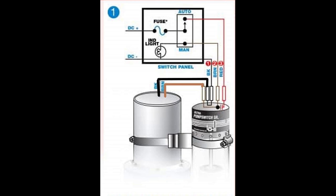One of the brown wires and one of the black wires from the switch go to your pump. The red wire on the switch goes to your constant hot — that's your automatic switch. The other brown from the switch goes to your manual bilge pump switch on your dashboard. The final black wire on the switch goes back to your indicator light on your dashboard or to ground.